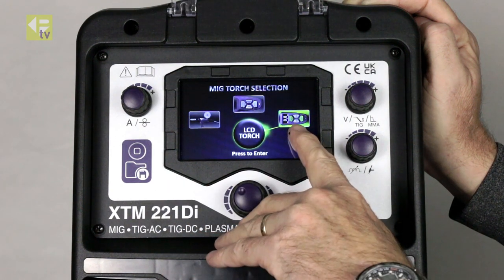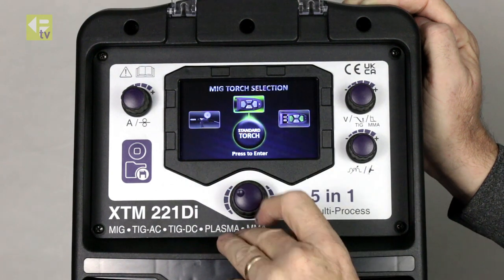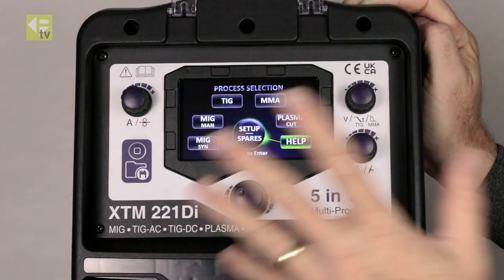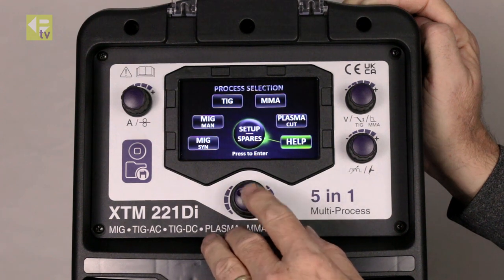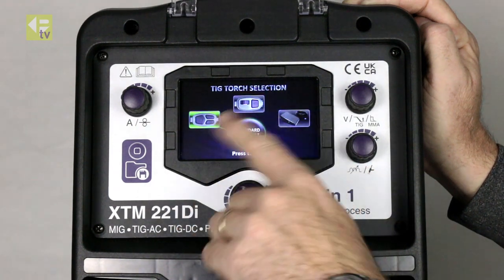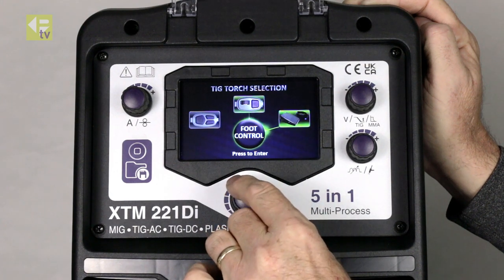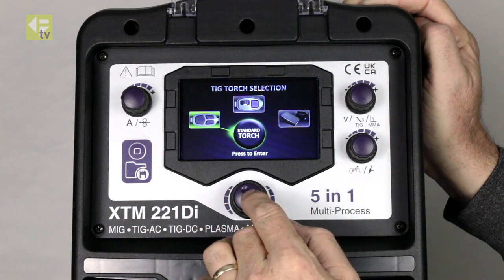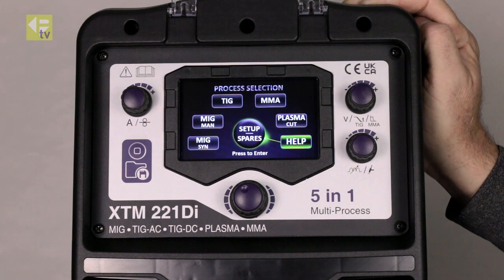I've got four buttons with a digital display. If I've just got the conventional torch, I'll click on that and that sets the machine for the type of torch I'm using. Likewise, going into torch to look at the TIG torch — there's a number of control options: three button, with a wheel remote, or with a foot control. I'm going to go with the standard option of three button and select that. So that's configured the machine ready for the type of torch we're going to use.